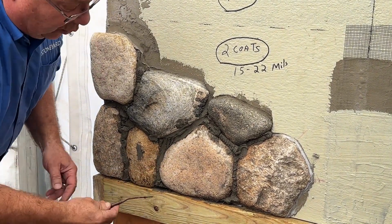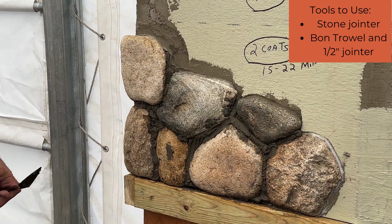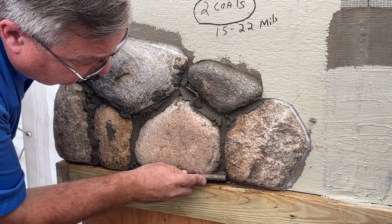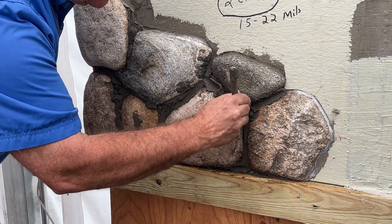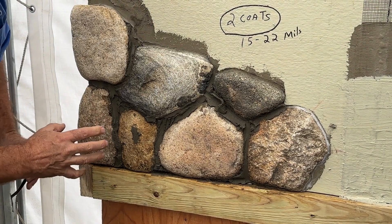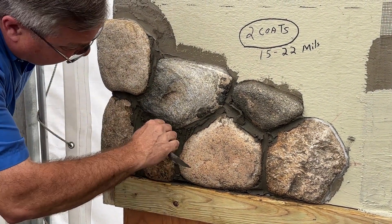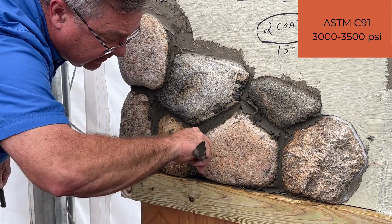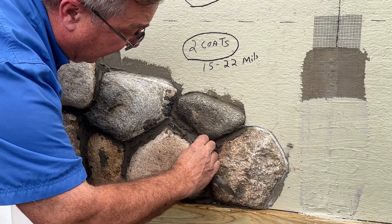What we're trying to do now is compress this pointing mortar into these joints. We've got a variety of potential tools. This one here is a nice one that you can quickly strike the joint — it's tapered. We're putting maybe 5 to 10 pounds of pressure onto these joints because we want the pointing mortar to go all the way back to the cement board. This particular M-Vis pointing mortar, after 28 days, has about 3,000 pounds of strength. This isn't just a Type S — it has acrylic latex and a variety of different ingredients. They call it a high strength joint.